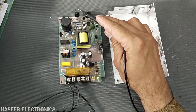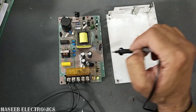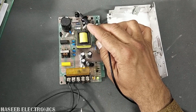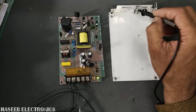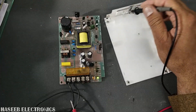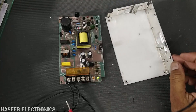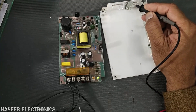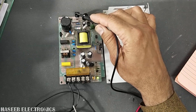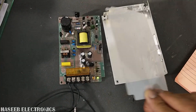The second condition: if you are using a metal-tab MOSFET and you connect it directly to the chassis, it can provide line voltage components to the chassis. When using a metallic-tab MOSFET you must use an insulator for the screw, use insulation paper so it does not touch the body. Also, heat sink mounting pads can touch components to the chassis — inspect them carefully. Insulation paper should be used between the component and chassis.